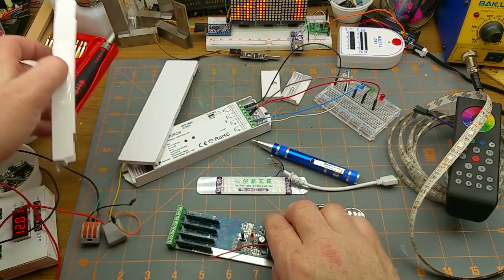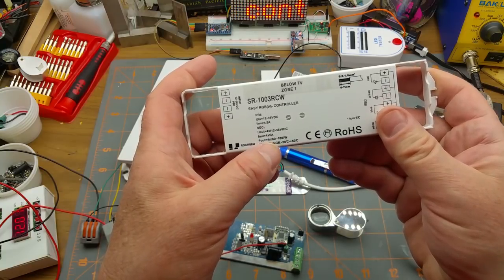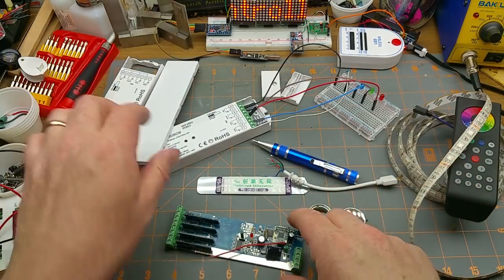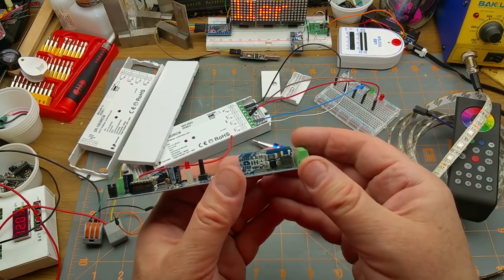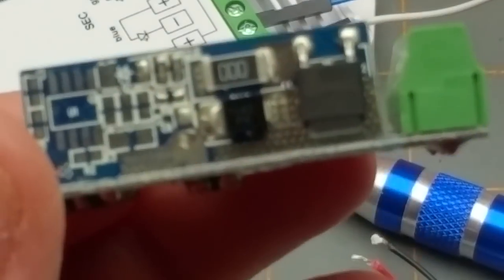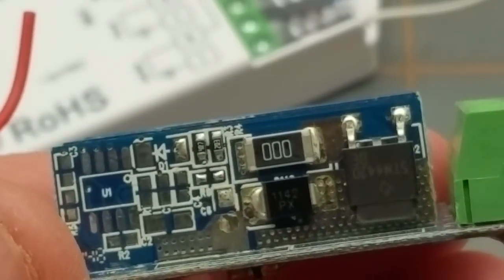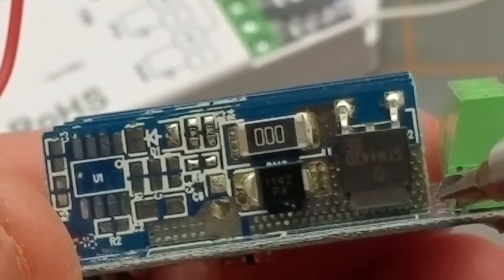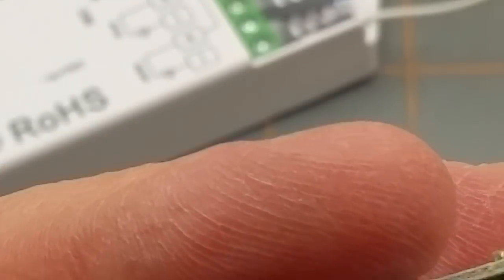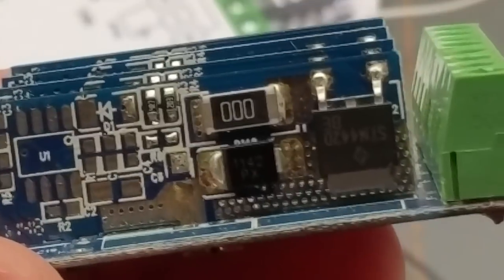And does that jive with this? It says current out 4x5 amps. So those are well underrated. I mean, they don't have much of a heat sink on there. Focus on this. No. Focus there. There we go. So for heat sinking, they're basically using some copper on the board and some vias onto copper on the back. So it's got some amount of heat sinking on it.